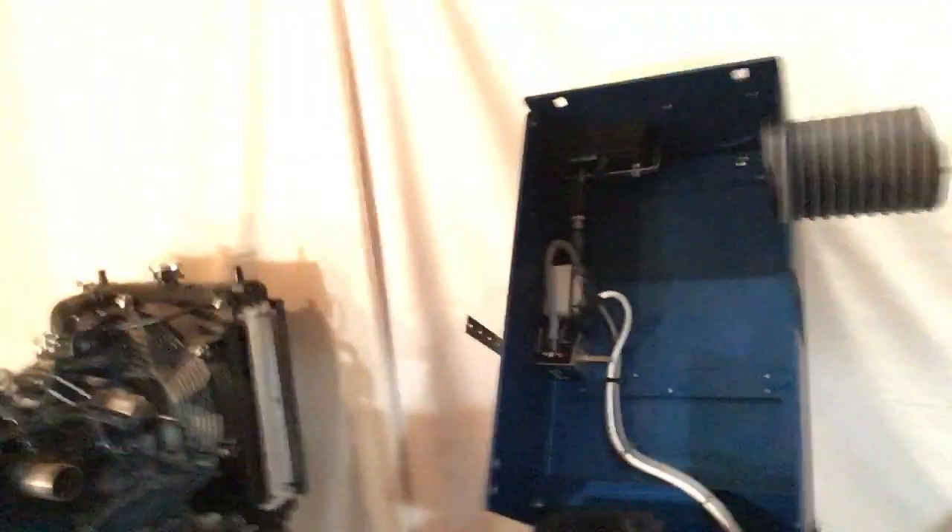In here is our fuse box — we have our fuses and our relay. Just a note about fuses here: all electric products can be used on floating systems. A floating system is when you don't ground the negative on board the boat, but you do have to have a ground fault monitor and fusing or double pole breakers on both the positive and the negative, because on a floating system each wire is treated as a live wire.